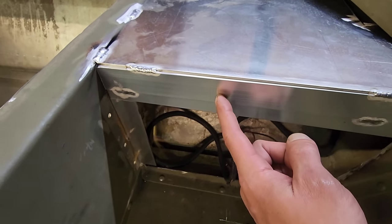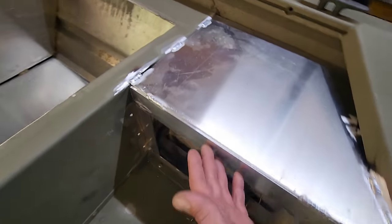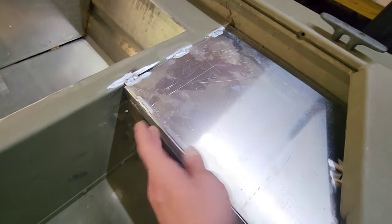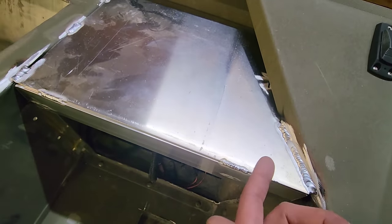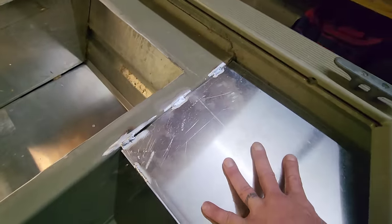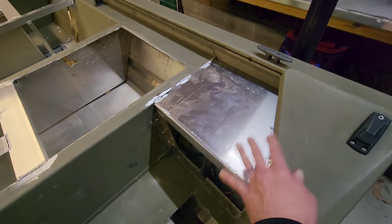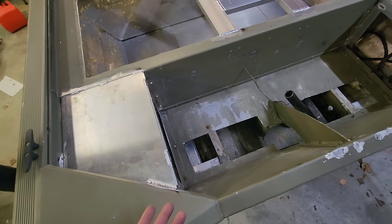It's another piece of the same 1.5 inch, 1/8 angle, and that basically just gave us a platform to install this piece to. And we welded it here and here and then all the way across the transom. Put some killer welds on there, and we welded it here and here and here. So this thing is very strong, sturdy. This is made out of 0.125 aluminum, and the way that worked out is pretty cool. I mean, it's best case scenario.